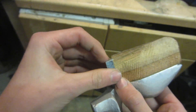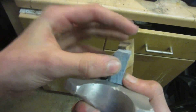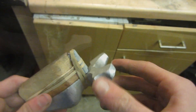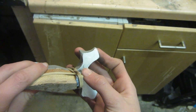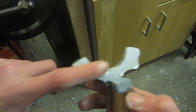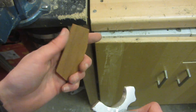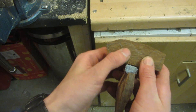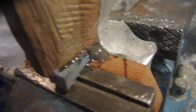The next part I'm going to glue on is this small piece of homemade micarta made from denim — denim micarta — just as a spacer here, and then I'll have some more wood up here later. Since it's a difficult angle to get clamps on, I've put some strong postman's elastic bands around it. Now I'm going to glue some hardwood along the top area here. Using a regular wood saw I very roughly cut this out, then smoothed off the back with some sandpaper. Once glued on, it's clamped up to set using a two-part epoxy.